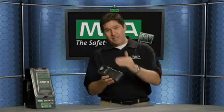Another standard safety feature is the instant alert feature. The user can press and hold the page button for three seconds, and that will automatically kick into an alarm to alert others that something is going wrong at the worksite — whether you are in a confined space, on an oil patch, or anywhere you'd be using the Altair 5 multi-gas detector.